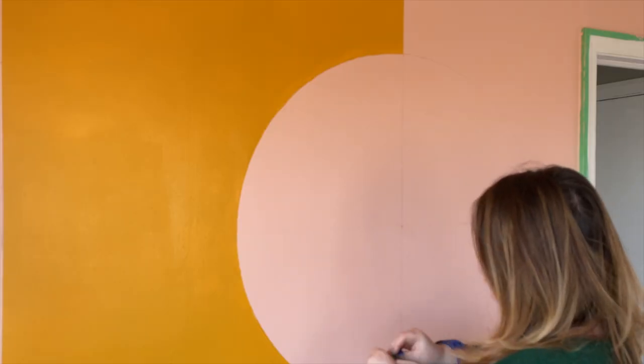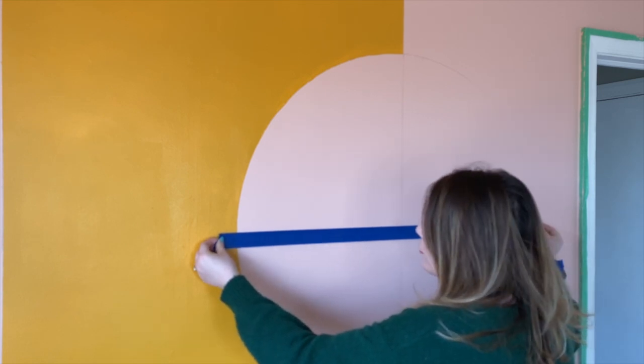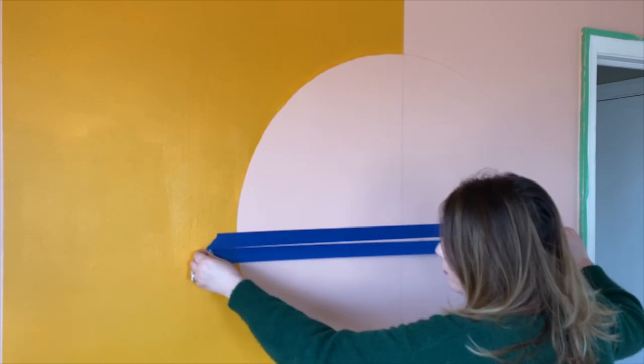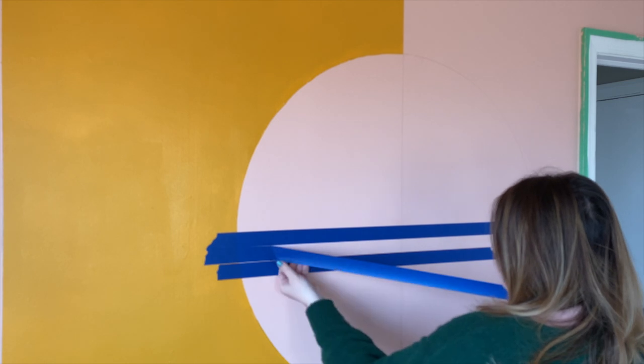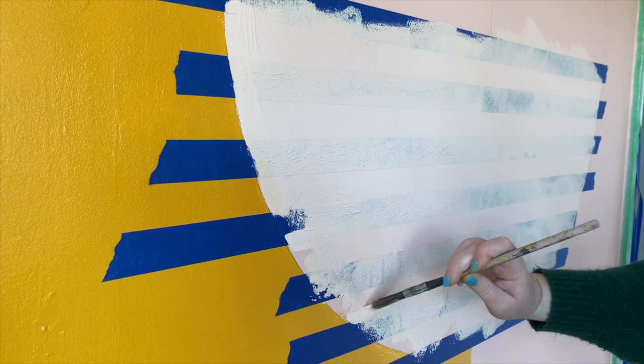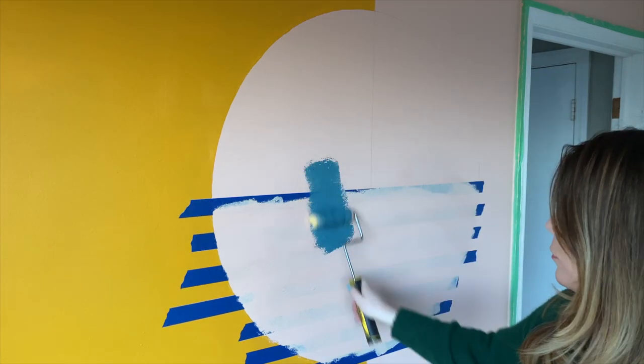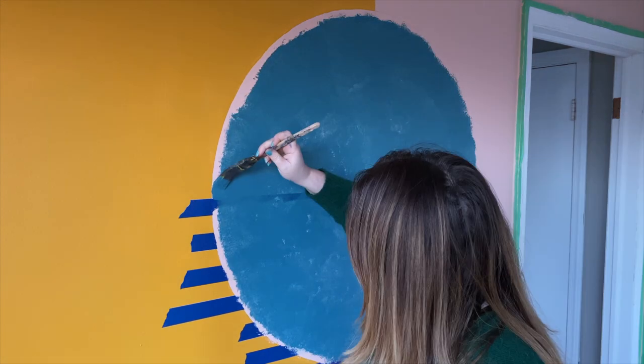The yellow is ready to go, so that means I can start on the blue circle. I'm adding thin stripes to the bottom half. Using painter's tape between stripes is a quick way to make sure that they are evenly spaced. Here's a trick to get crisp paint lines on these stripes: paint over the tape with your wall's base color before you add the stripe color. Just make sure that the base coat is totally dry before you move on. If it's not, a chunk of all your paint could peel off — ask me how I know. My base coat is dry, so now it's time to add the blue accents. To do that, I'm going to use a mini roller for the body and then that same small paint brush to do the curved edges.